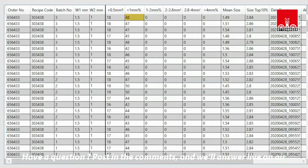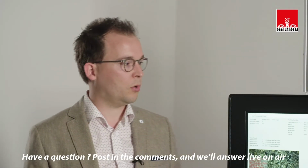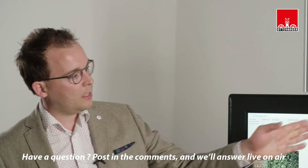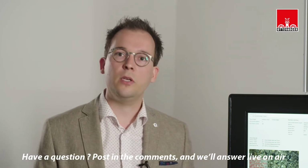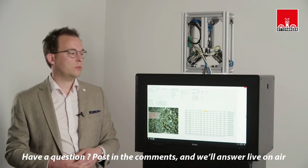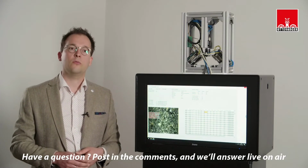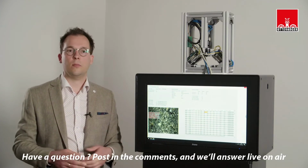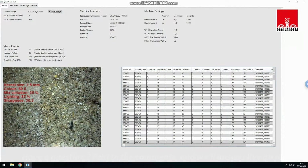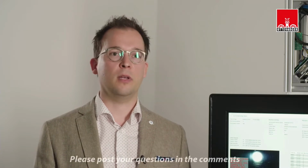You see the individual sieve fractions that you also have in your sieve analysis. We have the average kernel size and the top 10% of the kernels. And in case either one of the sieve fractions exceeds the bounds that you have set for that recipe, an alarm message is shown and the color of this cell lights up, and the operator can immediately adjust for this change in ingredients, and thereby make the recipe according to the specs. It's an online and real-time measurement system that allows you to immediately adjust your milling process.